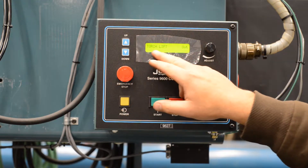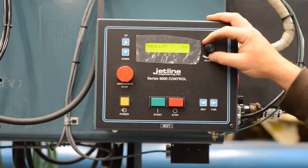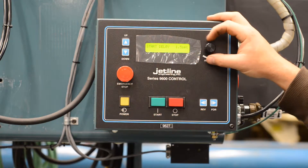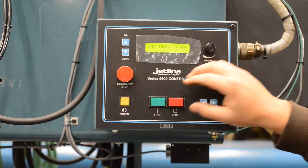Scrolling down, you'll have a torch lift. This enables you to actuate a pneumatic torch lift up or down via a solenoid. The next screen you'll see is a start delay — this is a start delay for travel before sequencing begins.